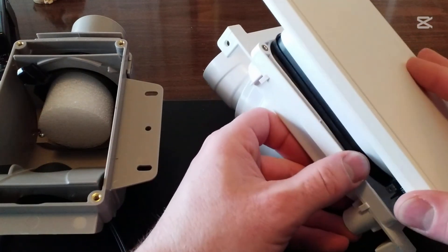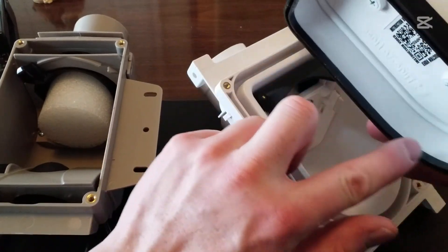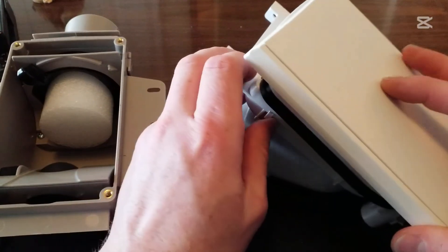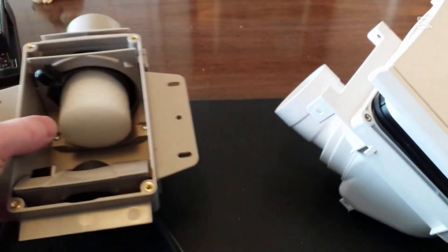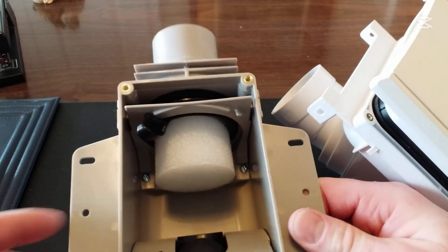The Hide-a-Hose box has to be sealed, so a door gasket is included, and if you need to extend it there are stackable spacer gaskets to ensure it remains a sealed enclosure. The Chameleon's sealing is done by the end of the hose seating against a ball, which means the box doesn't have to be sealed — and it isn't.